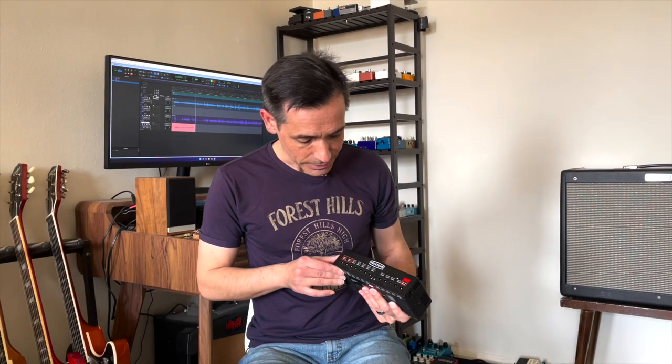One of the most important things is that every output has to be isolated. Here we have 12 outputs, so isolation prevents extra noises and interference in your pedalboard. That can happen because sometimes when we place the power brick close to specific pedals — it could be a vintage fuzz, it could be a vintage wah — there can be interference that mixes into your guitar sound. So we don't want that. When you go and buy a power brick, one key feature is isolated outputs.